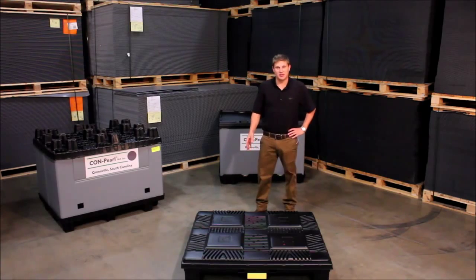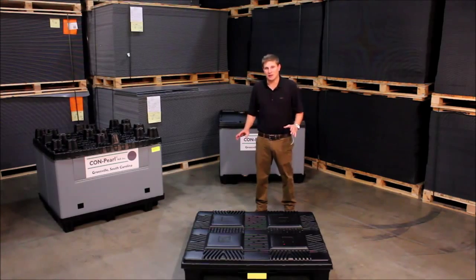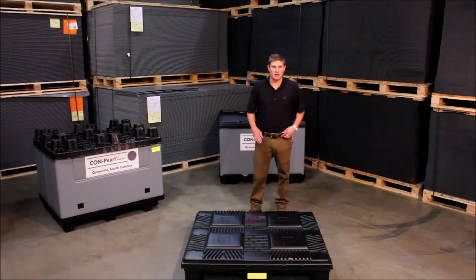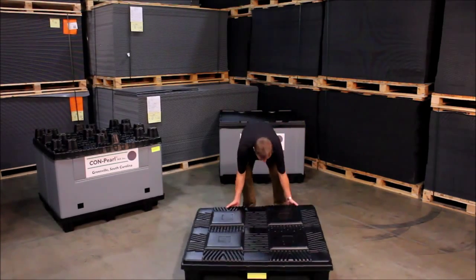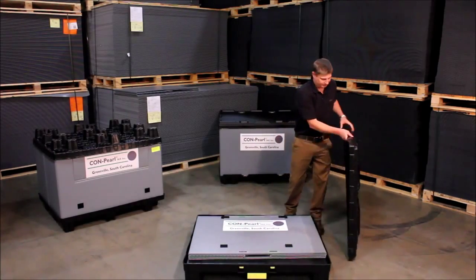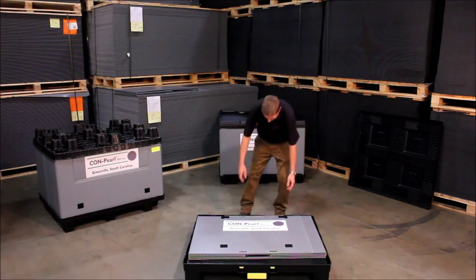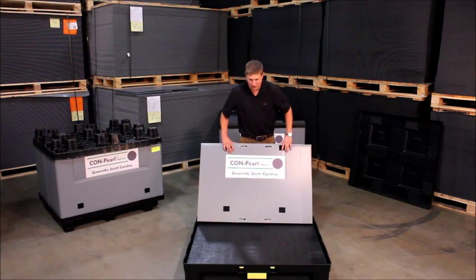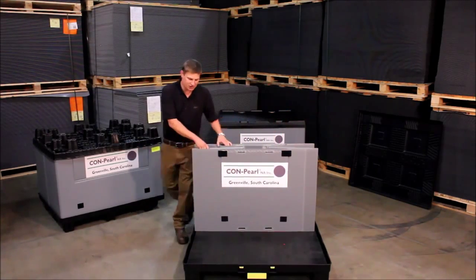The next type of system I'm going to show you is an injection molded pallet. There are only a few different sizes available in North America of the injection molded pallets that have a sleeve track to capture the sleeve, but the main advantage to this pallet is the flat deck. As you see across the bottom it's just a flat deck, which is easy to handle the sleeve and at the same time your parts don't get stuck inside.